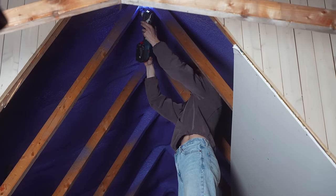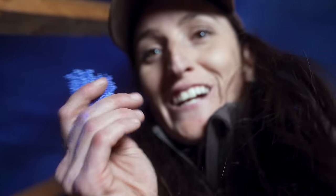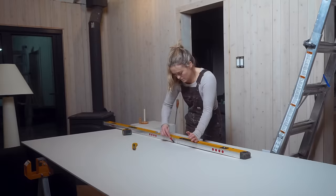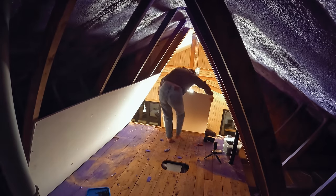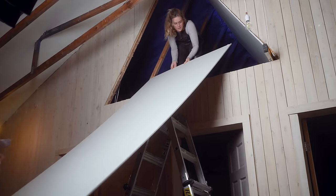When it's bad, it's when you're doing the ceiling. Thank you to everyone that said bless you. Oh, spray foam — you are the best and the worst all at the same time. You never get rid of it. The spray foam that is in the way is now gone. The second sheet is going to go up with ease. It's been a while since we did drywall and we just remembered: when you hang drywall, put your factory edges together. They are slightly turned in and that's what gives you the illusion that there is no seam.